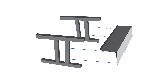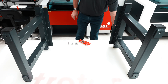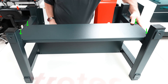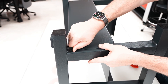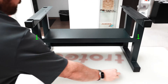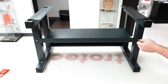To assemble the trolley, the left and right legs must first be bolted to the center plate shelf. Select six bolts and the six millimeter hex tool from the red box. Place the left and right side legs upright with the bolt holes facing up, then align the long center plate between the two legs, lining up the bolt holes from the plate to the legs. Hand tighten a bolt onto each side to hold the parts together, initially leaving the bolts slightly loose. Then add the remaining two bolts to the top until all four are placed loosely. Now rotate the trolley to access the other side and place the two bolts into the back side, one on each leg. Use the six millimeter hex tool to tighten all six bolts down firmly.